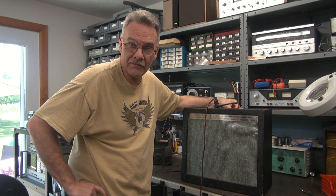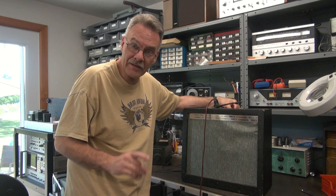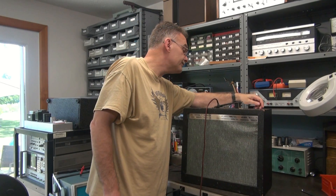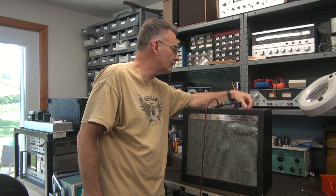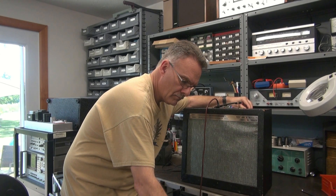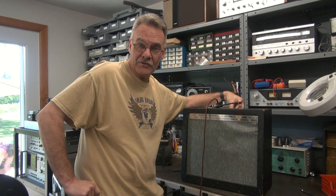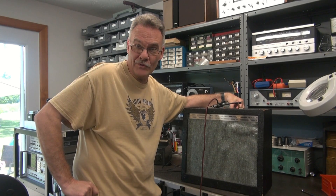Here's the initial test of the Delray after putting in the new filter caps. There is some inherent buzz to this thing, which I'd expect because it doesn't have a power transformer. They've got transformer coupling on the input, which I've never played with before, but it's clean sounding. Let's give it that tremolo — pretty aggressive. So it appears to be working. Let me see if I can do anything about that buzz, but probably not. Regardless, when you have one of these old amps, the best thing to do is change the caps. Just don't think about it — just do it, because they're always bad. See you again.